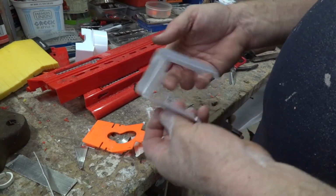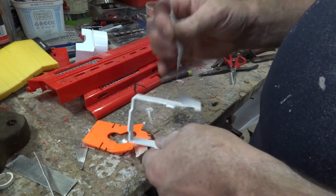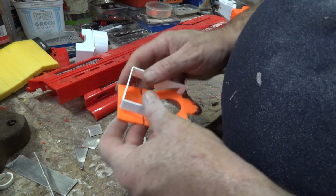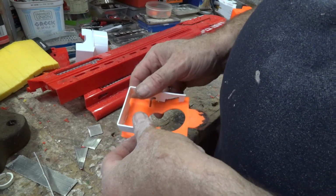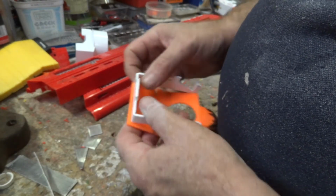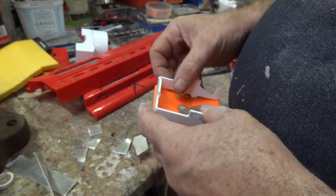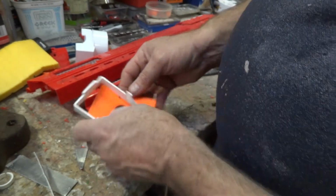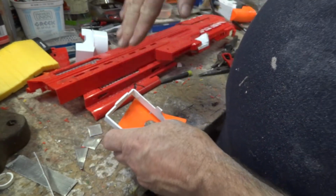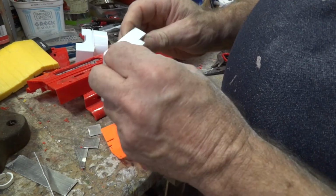Right, there's our little piece, cut to shape, still rough. And take off the tape now and the template. So let's have a look. So it's going to go in there. It's going to fit very nicely. The first thing I'm going to do is position it here, and I'm going to do it upside down so it sits quite nice. And just see how even the slightest bending of this corner to make that come down and down causes the top to bow in. So it's going to require some heat to actually mould that to the shape I want.